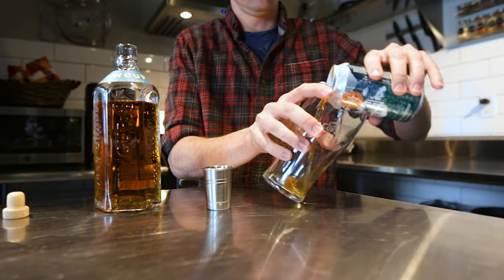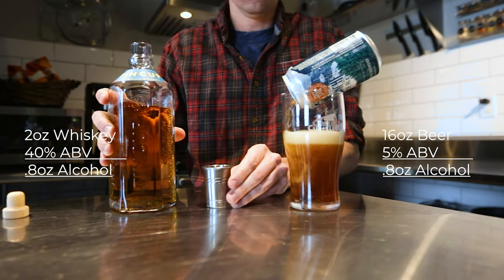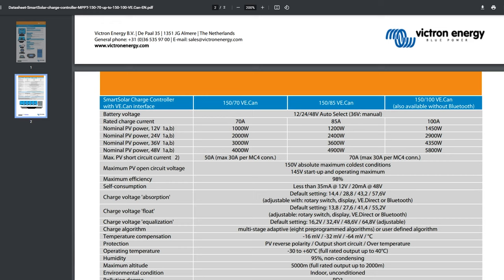Just because the amps went down, that doesn't mean that the charging rate necessarily went down as well — the array would still be charging at 4800 watts; those 4800 watts are now just being delivered at a different voltage. It's kind of like how if I've got a pint of beer and a shot of whiskey, they have the same amount of alcohol in them — the alcohol is just being delivered at a different ratio. The voltage on the beer is lower, so it needs a higher amperage drinking vessel; the voltage on the whiskey is a lot higher, so the amperage of the drinking vessel can be smaller. The end result is the same; the method of delivery is just different. This whole concept is the reason that the 100 amp Victron Smart Solar charge controller can handle up to 5800 watts when connected to a 48 volt battery bank, but can only handle up to 1450 watts when connected to a 12 volt battery bank.